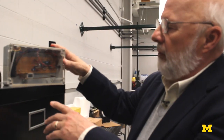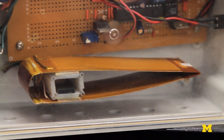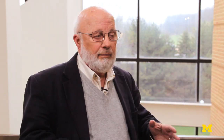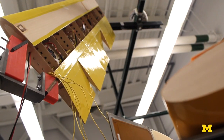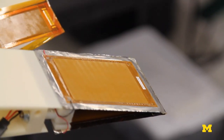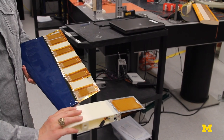This is an original version. The thing that makes this contouring possible is a thing called a macrofiber composite actuator. It's basically a piezoelectric composite, which means that the structure and the actuation device are all one thing — there's no mechanism like there is in a traditional airplane. That means it's potentially lighter and it can do these unusual maneuvers that a bird can do.